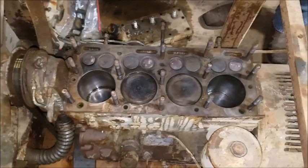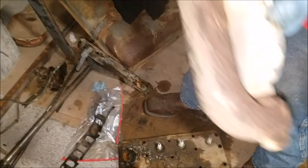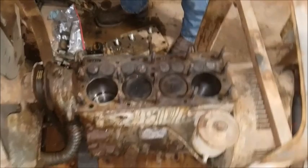I'm going to start off with a $300 manifold and carburetor rebuild kit. The first thing, that manifold down there. Pick that manifold up, let's see the little rot hole in it. We'd probably patch that. And there's this ear right here where the bolt goes, and that ear there is gone. You can see that hole right there that's rusted out, right underneath where the exhaust pipe threads in. But let's just see if you can throw it on and make it run, and then see where it goes from there.